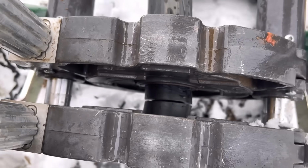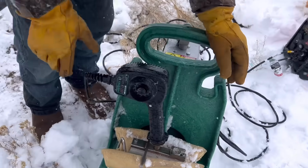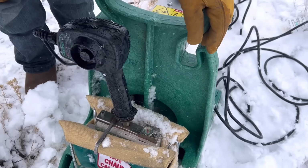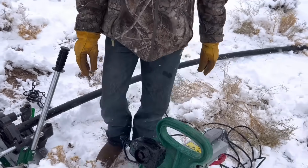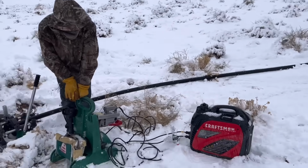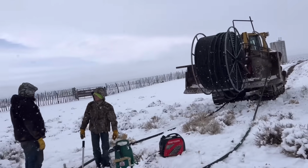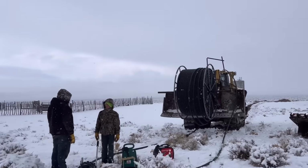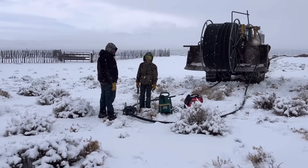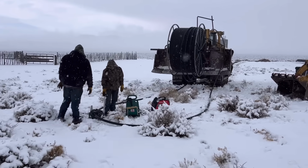All right, how's our heat? It's gonna be a minute, we just gotta pump it in. We gotta get that thing up to like 500 degrees. When it gets to 500 degrees, we'll put that heater in there, get the two faces of that pipe hot, and then squeeze them together and it'll be welded together for time and all eternity.